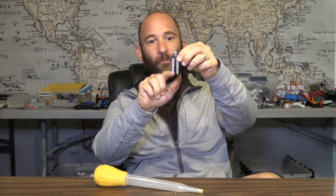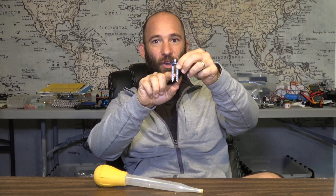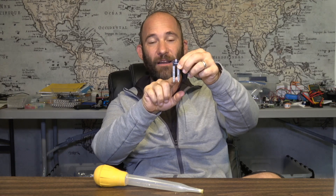What this soil moisture sensor does is read the resistance between its two prongs — a positive prong and a negative prong. You put this into the soil and the current tries to flow between the two prongs to measure the resistance. The more resistance there is, the drier the soil; the less resistance, the wetter the soil. We're able to take that as an analog reading and get a number output.